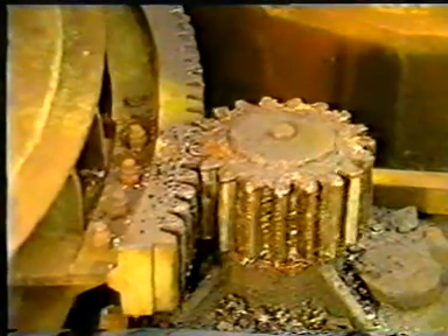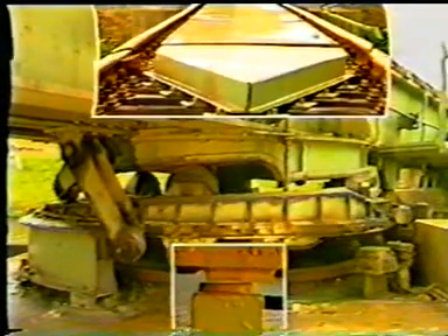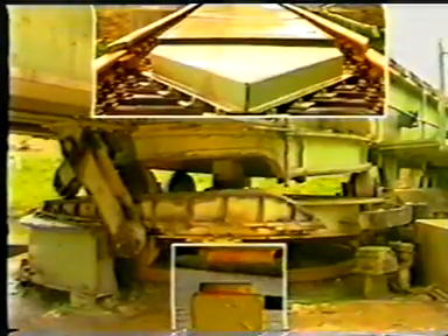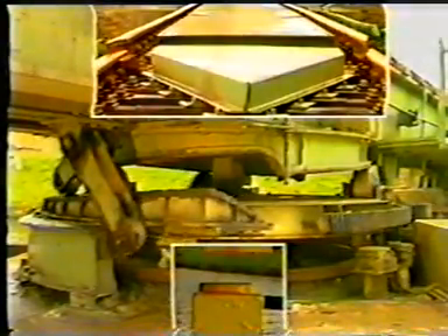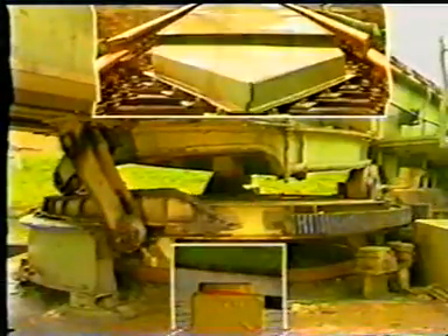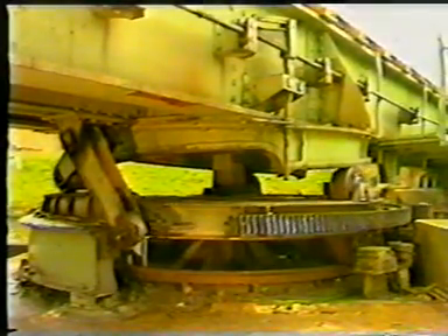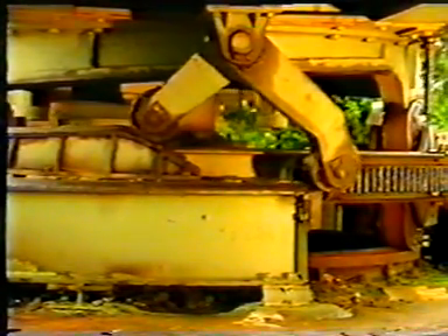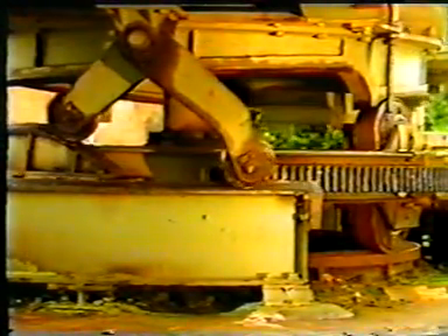A pinion rotates a circular carriage by means of a toothed rack. The upper wheels pass along a coil-shaped track and lift the bridge and set it free from the supports. The bridge does not yet rotate as one roller of the crank prevents this movement. The moment the bridge is lifted sufficiently, the crank rotates. The lower roller now follows the horizontal track. The other roller is supported by an inclined plane, which prevents the bridge from rolling back along the slope.